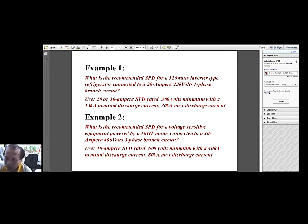Then you will notice that there will be a blinking of the light. If you are inside your office and it functions, you will just notice a very fast blinking of the light. And that means that your surge protective device would have functioned. It would have allowed the passing of that big surge current to the ground. Okay, very fast.